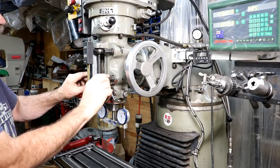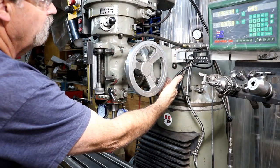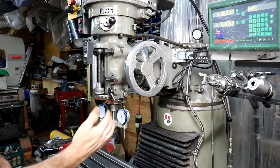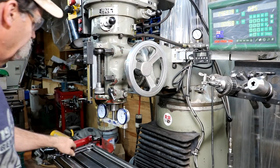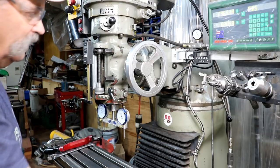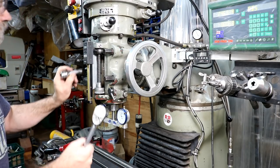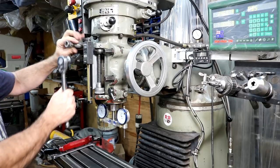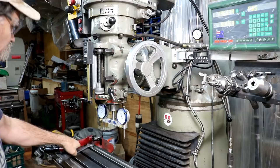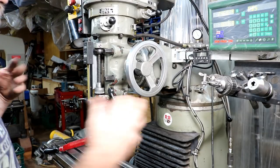The tools for my mill are all three quarters — these are the four in the front, and then the three over here, and the adjusters, this one, and the one in the top and the back, are all three quarter inch. So you need a three quarter inch wrench and a three quarter socket. In this case, I need an extension to clear the stem here. That's all the tools I really need — no hammers or anything.